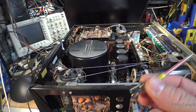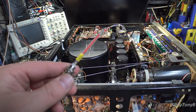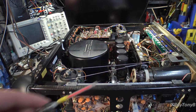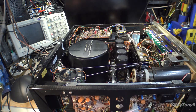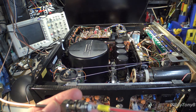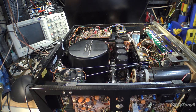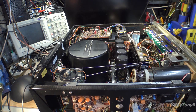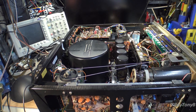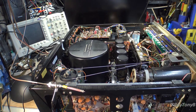You can just use your normal coax cable and plug it in, then take a little alligator clip and connect it to ground. Now we have a really nice little injection probe. If you go back to my Pioneer SX-750 video, I believe we had to use this to troubleshoot it — you'll actually see me using that in that video. Let's turn this thing on and see if we can inject some signals, and let's draw up the schematic to get a better look at what we're going to examine.